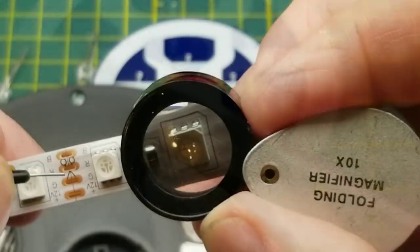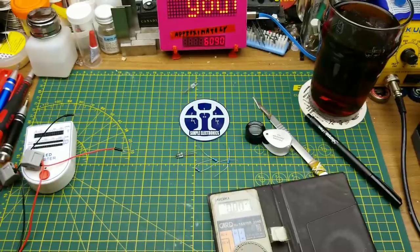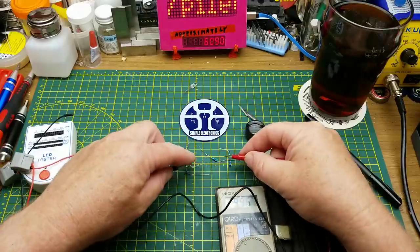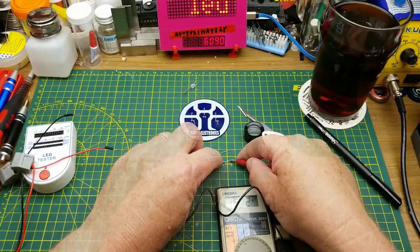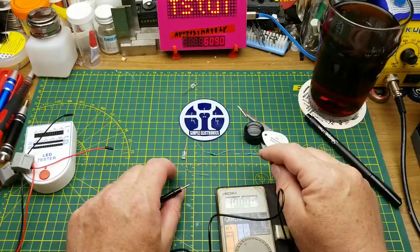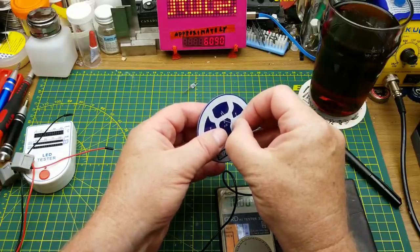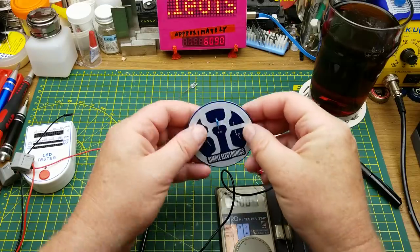I'll quickly check these three resistors because I'm pretty sure they're different - this one looks different than the other two anyway. That one is 10k, that one is 4.7k, and 550 ohms. I'm thinking that just because of the different efficiencies of these LEDs, he's put the highest resistance for the blue one and the lowest for the red one. There are no instructions with this; I know he's done a video on it but I'm just winging this.